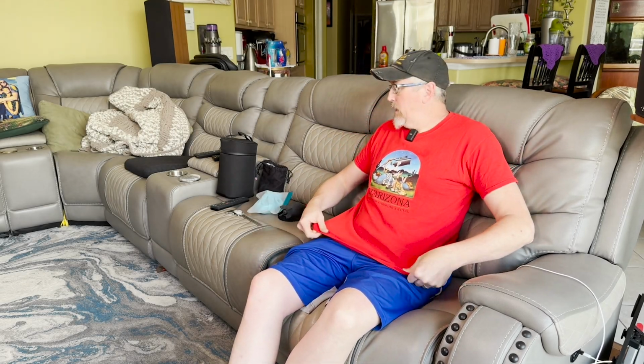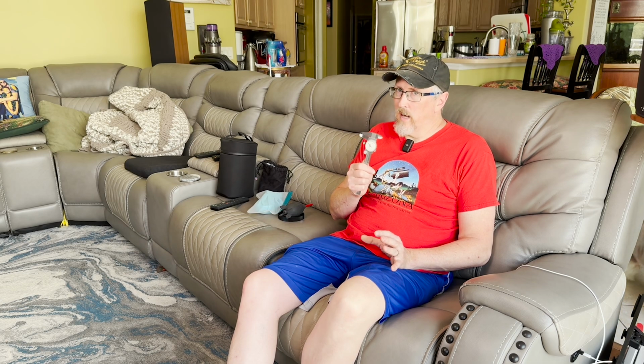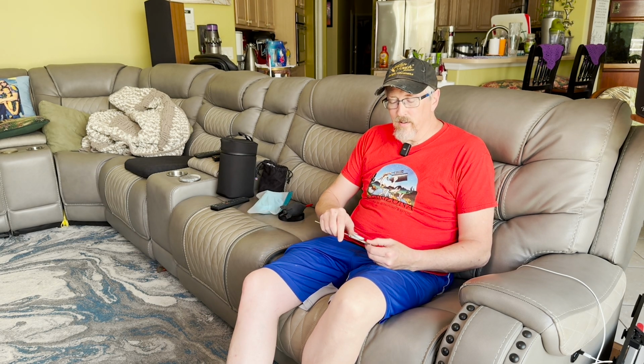We have a couple things here to talk about. We're going to start with calipers. If you are in this hobby, or any other hobby that requires very delicate management of measuring, a set of good calipers is worth its weight in gold. It doesn't matter what it is, even in woodworking, setting up routers, setting up other machines, a good set of calipers is worth its weight in gold. I actually reload ammunition, so my presses and things require high levels of precision, but this is just a good investment. A good set of calipers will run you $150 to $200. That's for a really good machinist set. You can get a set of dial calipers or digital calipers, a mediocre set, for probably $30 or $40.